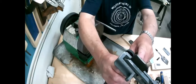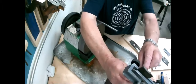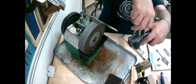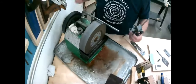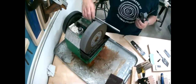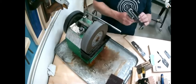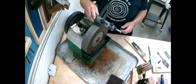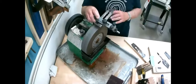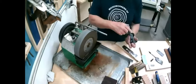Having established where my blade is cutting, if I want to make the angle slightly steeper to get further towards the back of the bevel, I would pull it back slightly. If I need to make it a little further out, I'd push it out slightly. On more modern Tormek machines they have a micro-adjuster, which is really nice. But the first thing is: don't just set the thing up, measure the angles, put it on there, sit there, and run it back and forth. You've got to keep an eye on it and make assessments along the way — the earlier you figure that out, the closer you'll get to what you want.